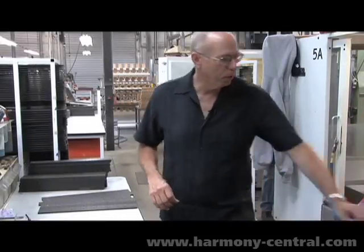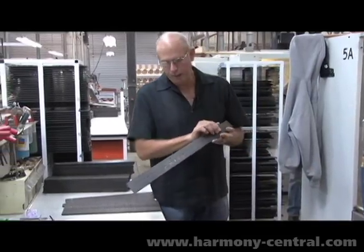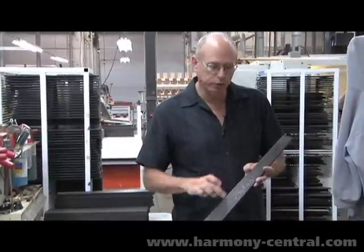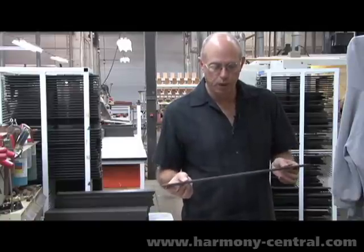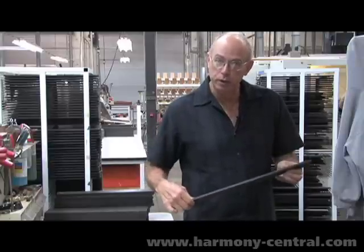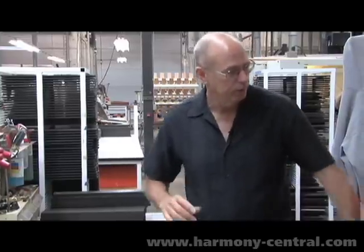We're making fingerboards here, made out of ebony. This board has been milled to an exact thickness. There've been 3 index holes put in. These are tooling holes, and we're going to be able to line a lot of stuff up whilst we do all the work. That's going to register where our slots are. It's also going to be what we use to pin it to the mahogany when we glue it onto the neck.